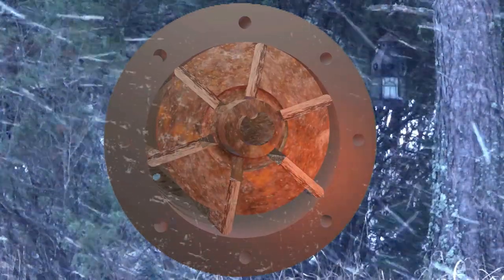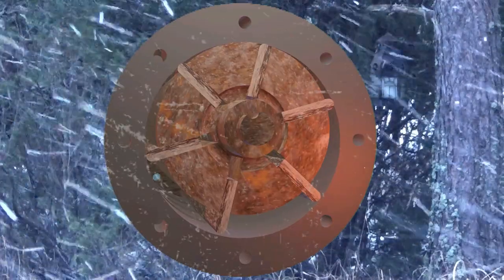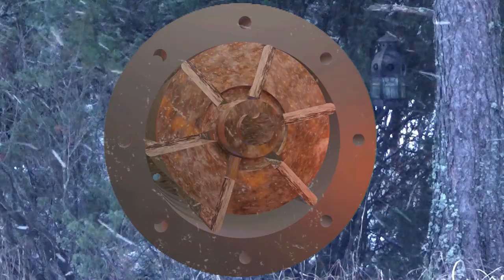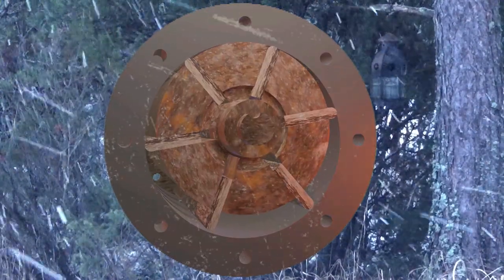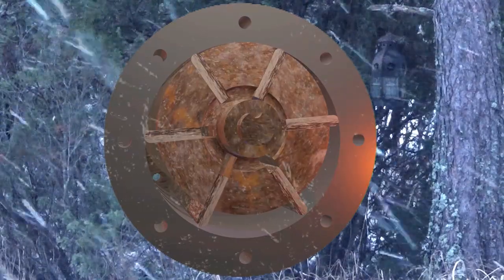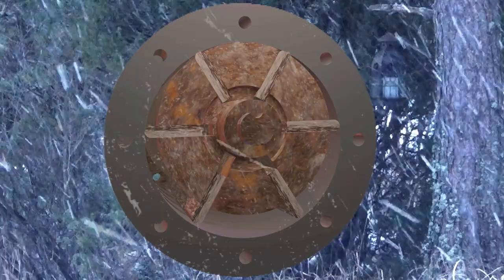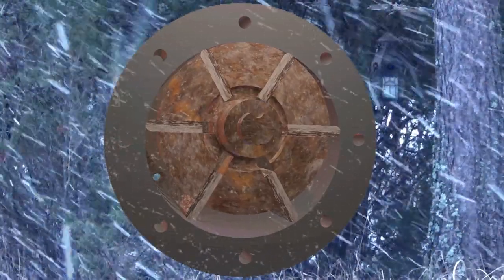The vanes are pushed against the cylinder wall by two actions. First, there is the centrifugal force, which is not great in this case. Then, there is the oil pressure under each vane. The hydraulic force on each vane is greater at the low pressure side, thus forcing the vane out. When the vane rotates to the high pressure side, the oil viscosity keeps it against the cylinder wall.